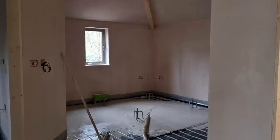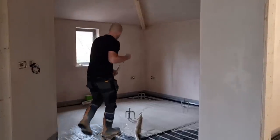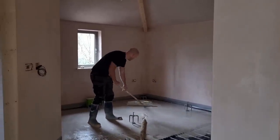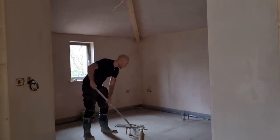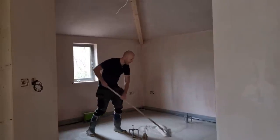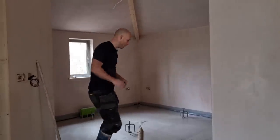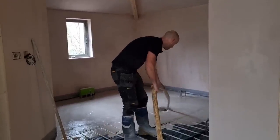That's it. It flows so well though, doesn't it? That's pretty good, I'd say. Now that is where you want it. And it doesn't give you too much pressure around the perimeter, because I suppose it's only 50 mil thick. It's not like pouring concrete at 200 mil thick. Exactly that. It gives just the right amount to push back any expansion you've got there or any polythene. There's not a lot of outward push other than that.